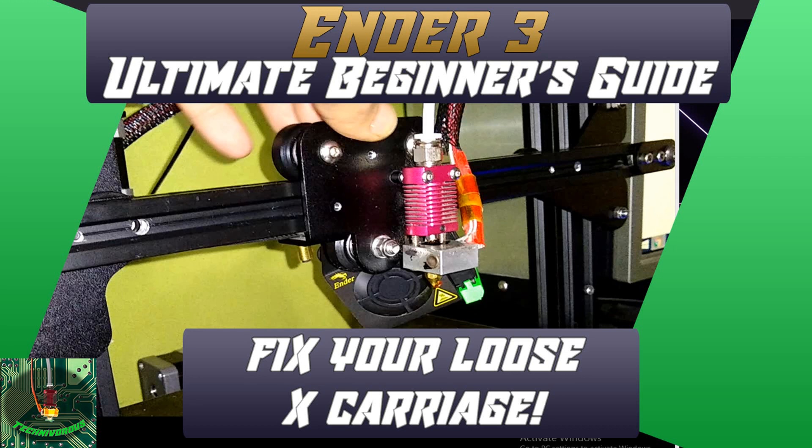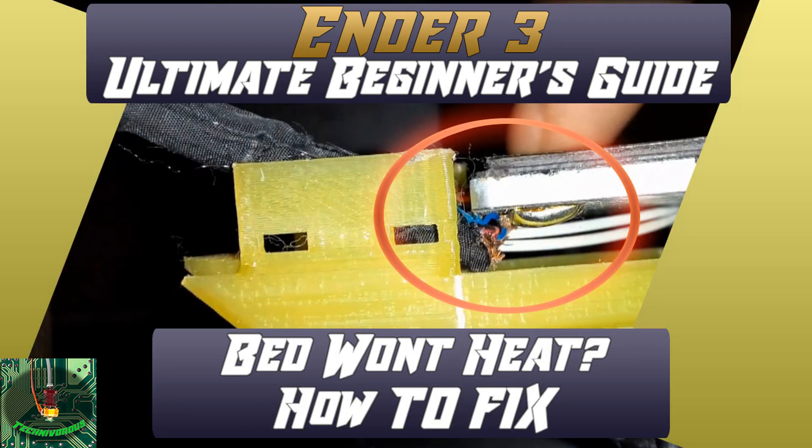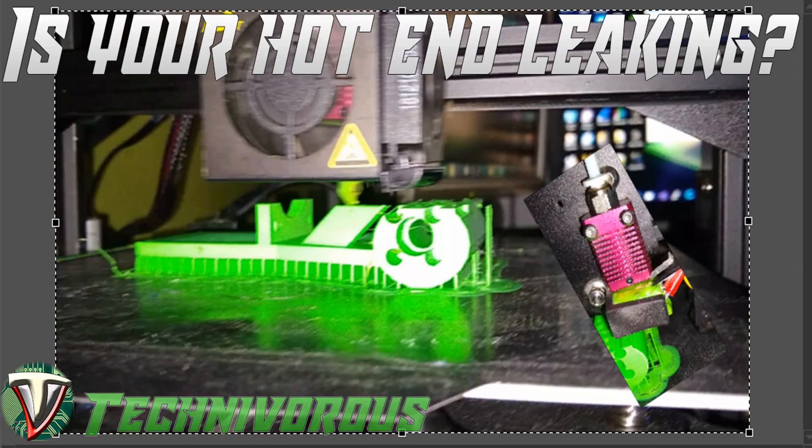After a long period of continued use — about a year running — here are a few things I've also had to do to the machine. I had to re-solder the bed connection after the bed stopped heating; the wires attached to the bed and main board came loose. I've also had to clean the whole hotend after a bad clog — this has happened a couple of times, mostly caused by not reseating the nozzle properly. Once you deal with this once or twice, you'll make sure to do it right, and you won't have to deal with it again.